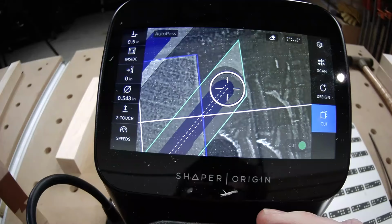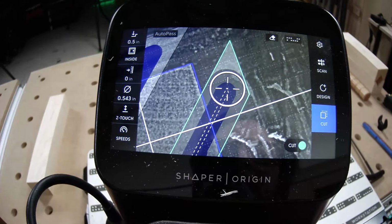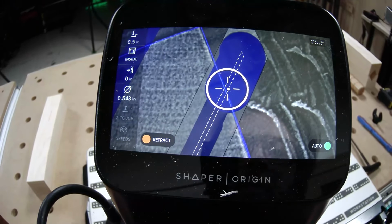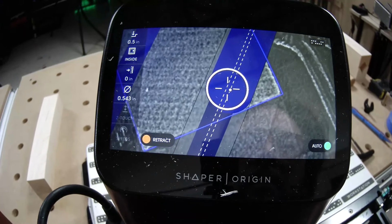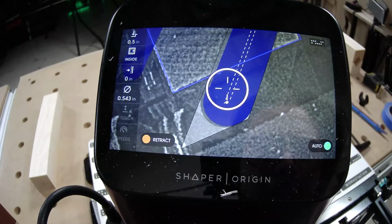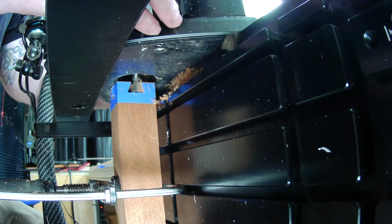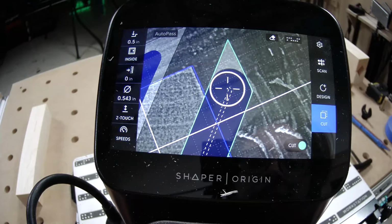All right, here we go. No pressure. The key here is going to be to plunge all the way down, move cleanly through this cut, make sure you're focused, stay centered, no retraction, and then once you're well beyond the other side but not cutting into the workstation, you could retract. Oh, you got it set up so you can just keep going around. All right, that's slick. As long as you've got clearance on that support bar there, definitely go ahead and continue around.